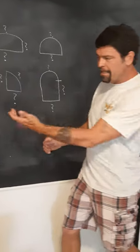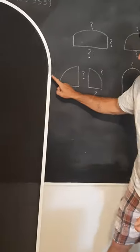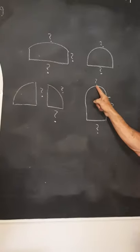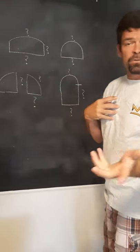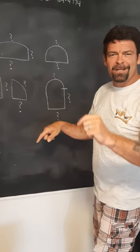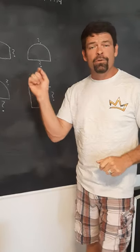And then finally, the one that's on display here — we always have our width. You have the height right up to where that arch starts, which in this case is right here. I'm going to guess this would be about 60 inches. Then from there, you measure dead center. A good quality company — Quality Screens, Window Screen Manufacturers, Metro Screenworks — will know exactly how to bend that, package it, and ship it directly to your home, making it as easy as it can be for you as the homeowner to build your own arch work, or at least have someone else build it for you. But you can measure it yourself, taking all the guesswork out of it.